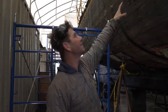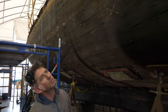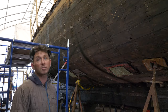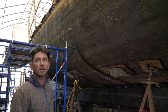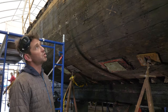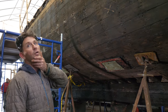This right here is a plank at the turn of the bilge which I have marked out for extraction. We've clearly got deteriorated frame heads — looks like 100% at the top, and it's a bit soon to tell how many are at the bottom. I'd like to get it pressure washed first. We need to pull this plank off so we can see what those frames look like mid-span. There's a chance we're going to be removing all these planks at some point, but we don't know that for sure yet.